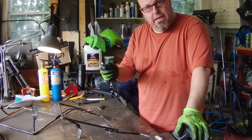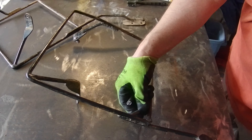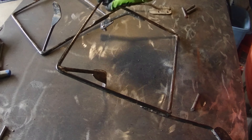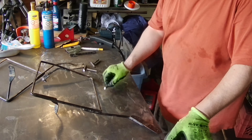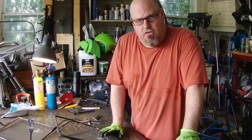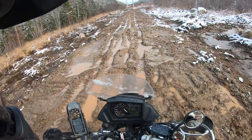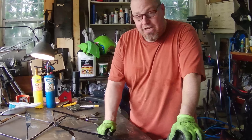We've got these gussets cut and the angles are mostly right. We're going to gusset every corner — that gives them some more tie-down points plus it'll reinforce these corners. Now, this is fairly thin rod that we're using, and yes, they bend when you go over in an accident. But the whole point of this was so that when he drops the bike, these would actually bend.